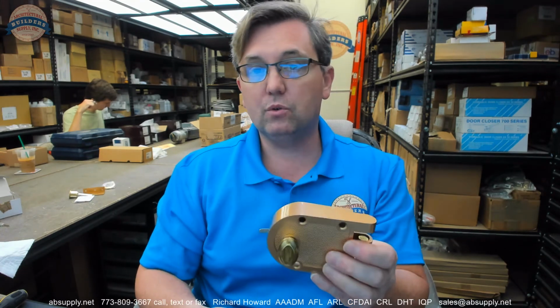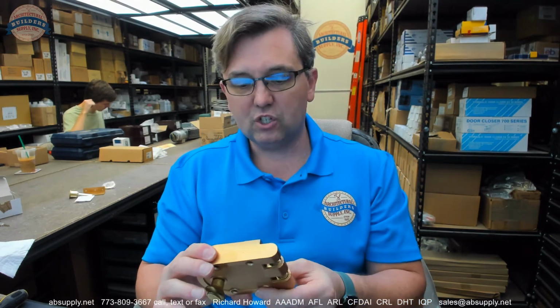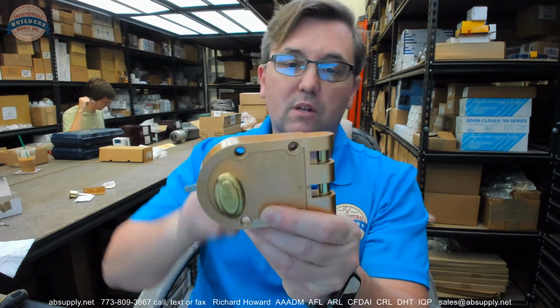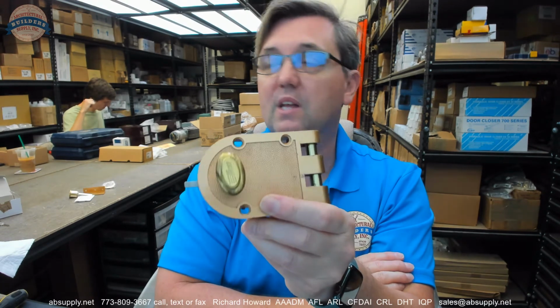And the only way to move that bolt is to move the lever tumbler out of the way and then get up and around, or back and down around that fence post. So that's why they call it Jimmyproof. If it's in the locked position, you're in effect destroying the entire lock or breaking it off the door to get it to move.